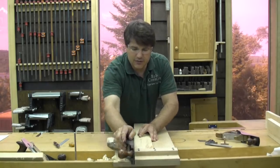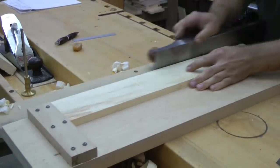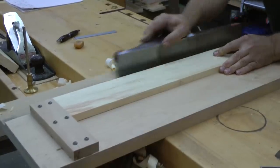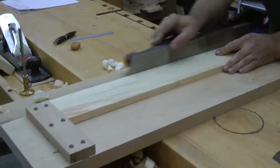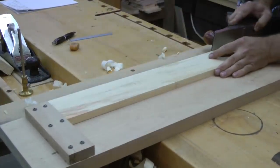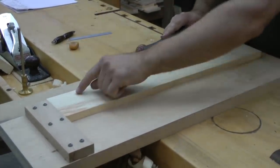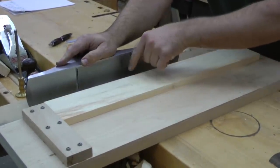I am going to advance the blade out too and get a little heavier cut to speed this up. I have a tendency to push directly opposite of the blade with my left hand. I am just trying to get the edge parallel to that gauge line. It is getting pretty close. Now it seems to be a little heavier here than it is up there, so I am going to go part way and then just pull the plane away so that I don't leave a shaving there.